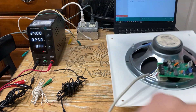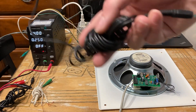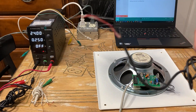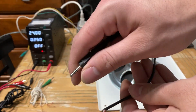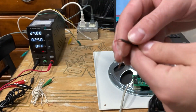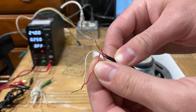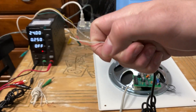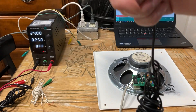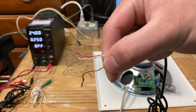For audio cables I'm going to use a 3.5mm cable for this application. Usually when you buy these you have both ends on it, but I chopped one end off. You should be greeted with one white, one red, and a bare copper. In some cases you might also have a green wire in addition to the red and white — some manufacturers use that bare copper wire as ground.